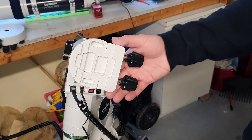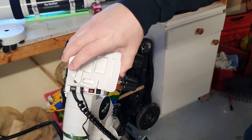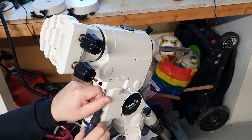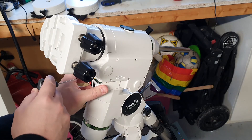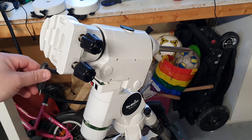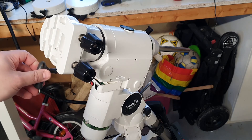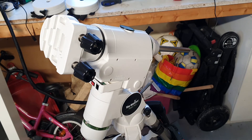When that is finished, check one more time to see that there is no movement whatsoever and the adjustment is completed. Take a Phillips screwdriver and gently remove the two screws holding the electronics box in place — the adjustment screw is located right inside there, below the electronics box. Just like with the declination axis, tightening the rounded side of the right ascension worm drive carrier moves it closer to the gear, and tightening the back side moves the gear assembly further away from the gear.